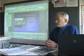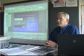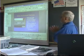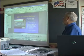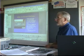After explaining the differences between varieties of aerial lifts, the instructor then moves to safety, protection from falls, pre-start checklists, and inspection of components. So, fall protection, if we talk about it, what's it say here? Maintain fall or safety in an elevated platform, maintain a safe footing, good housekeeping, use proper access and egress, do not exceed the capacity. If the platform is snagged and cannot be moved with the upper controls, the occupants must leave the platform before using the lower controls.